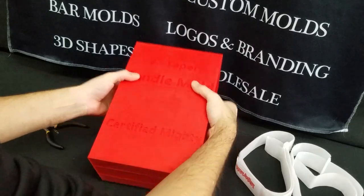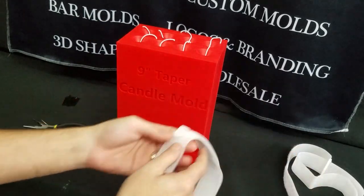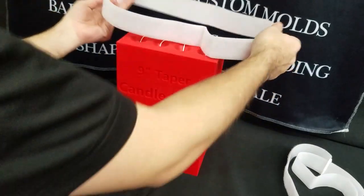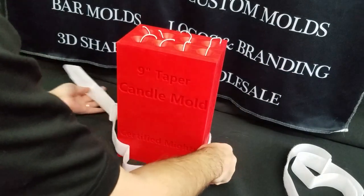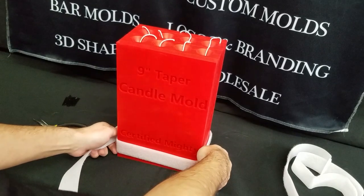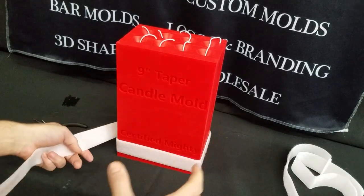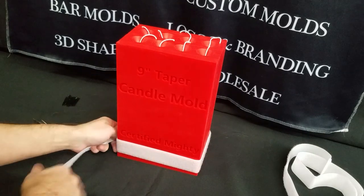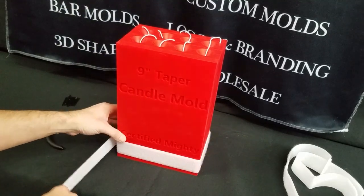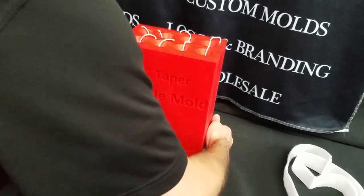Now we can go ahead and stand it up. The biggest part is to make sure you strap these — you always want to use straps with a Mighty Mold. It is a separated mold with multiple pieces, so you want to make sure there's tension and it's all being held together tautly. But what you don't want to do is over-tighten. You don't want to yank it to where it starts bowing and twisting because then you can cause a leak. Just get these secured tightly, not overly tight — pull tight and then wrap it around. Now it's closed. We'll do the same thing on the top.